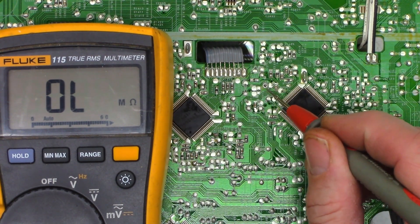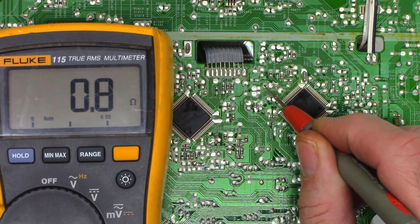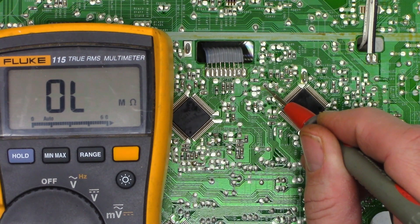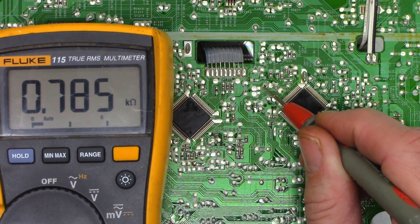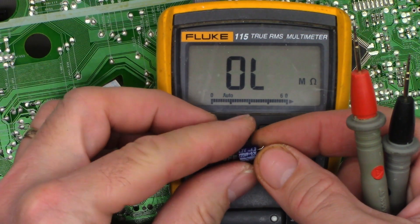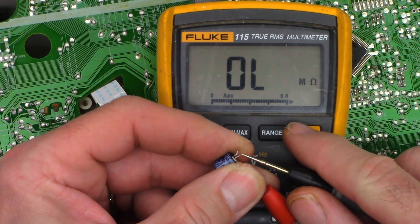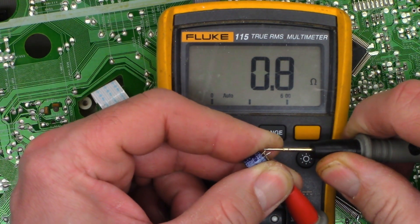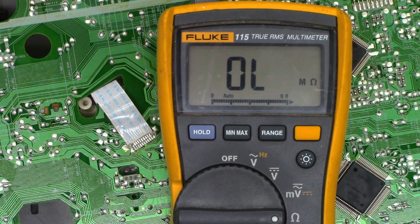One lead is unsoldered. Let's go ahead and measure the pad right here — I'm seeing 0.8 ohms. And now I'm seeing 785 ohms. So that capacitor definitely is bad. If I measure just this lead, I should see 785 and I do. That is the ground lead that I did unsolder. Well, there is the culprit. Let's go just to an ohm test across the capacitor — I'm seeing 0.8 to 0.9 ohms. That thing is bad. Let's go ahead and grab another 220 at 6.3, pop this thing in here, change that transistor out. I think this thing is going to be golden once again.